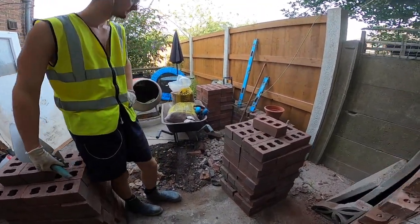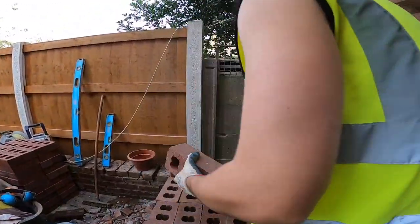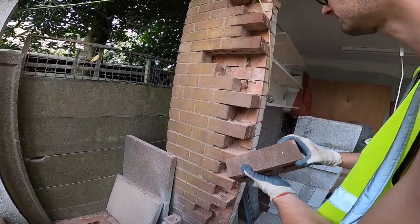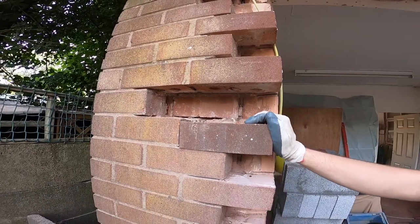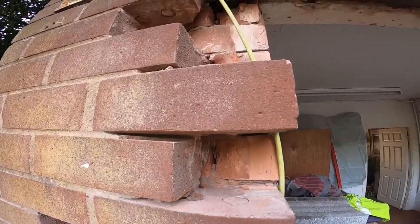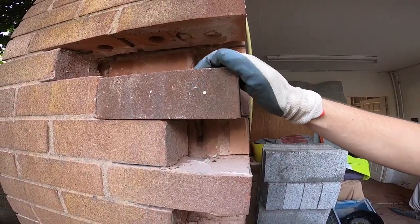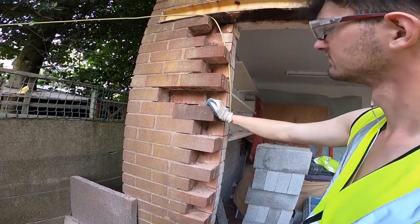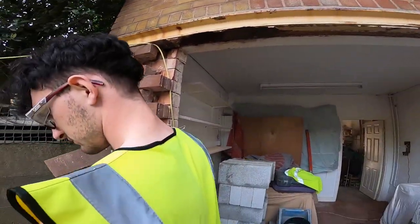The bricks, you've seen us have an absolute nightmare with the bricks. I'll show you. That's one of the roping ones through the ground. That is a good match. I know it's a good match because I recognise the bricks. They're definitely a Madeley mix. If you see the little indents in them, they used to have little white stones in them. And the old ones really used to have loads in. But obviously they've all weathered out. So it's going to be a good match.